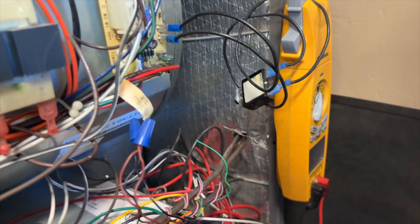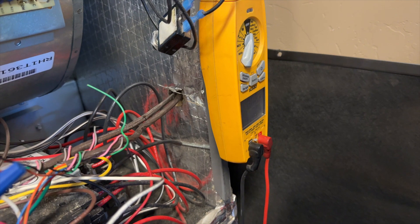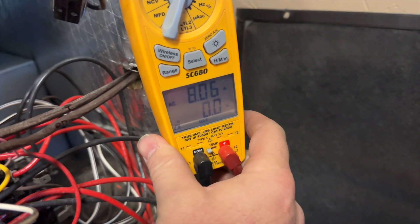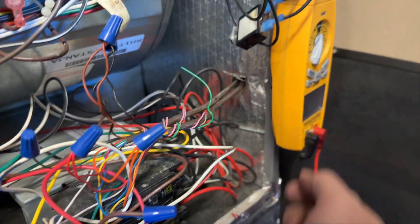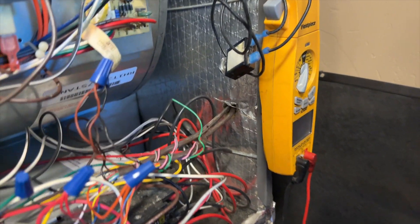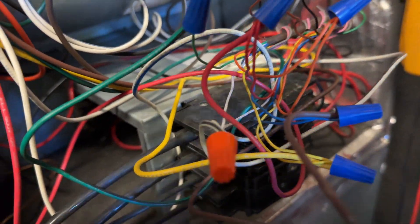When I called for cooling — which is just Y — it immediately just popped. But we were getting eight amps, so that explains why this is popping. It's definitely in our Y. We're going to go ahead and start isolating Y and see what it does.